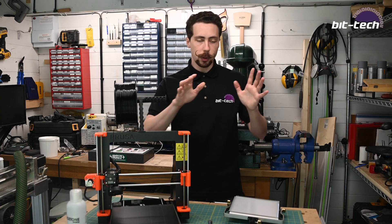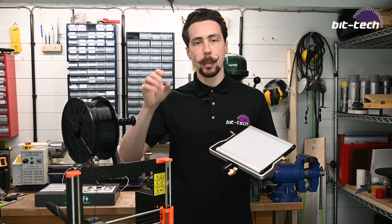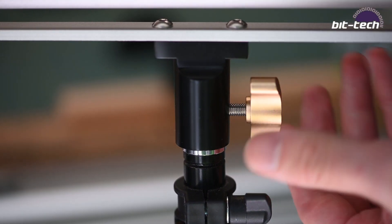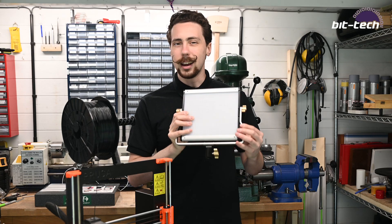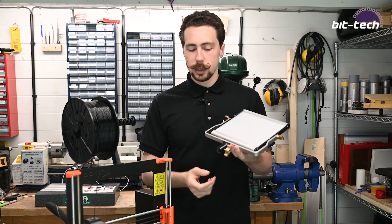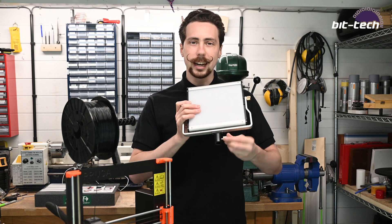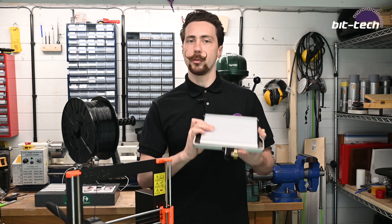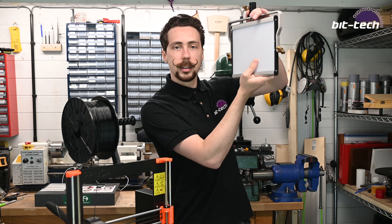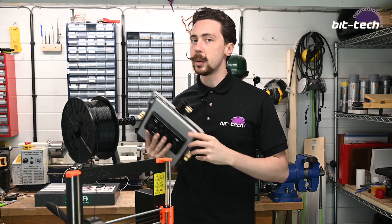Alternatively, I could just go through and explain what I've gone and done. The way these lights actually attach onto the tripods is very simple — they have a male connector on the tripod top itself and you simply slot it on using this socket and then tighten it down with a set screw. But if I'm making a 3D printed version out of plastic, whereas the tripod ones are metal, it's probably just going to damage it over time. Plus, screwing it constantly in and out takes time. I'd rather have a simpler mechanism where I can just slot it in and unclip it when I need to move a light.